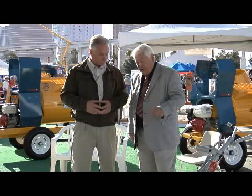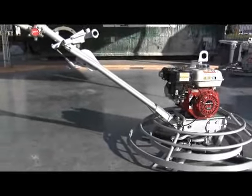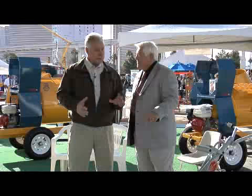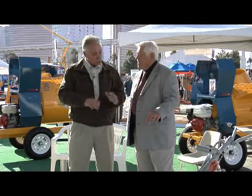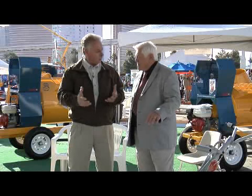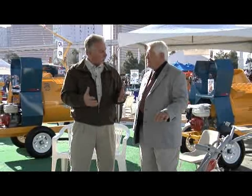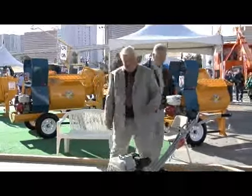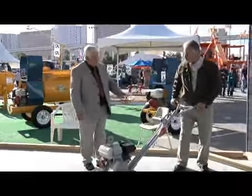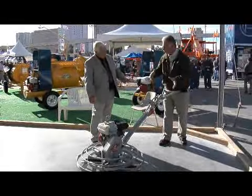There's something unique about this machine — it has a clutch. We have a patented Dyna clutch. All other manufacturers use a centrifugal clutch, kind of like on a mini bike, so you have to throttle the machine up to full throttle to get your blades to spin. On ours you don't have to do that. You can throttle it all the way up and the machine will just sit here. When you're ready, you move over here to run the machine, put your clutch into gear, and the blades start to spin for finishing.